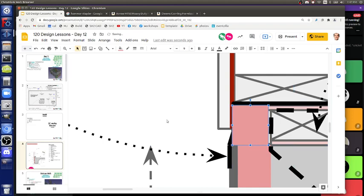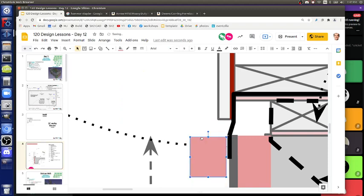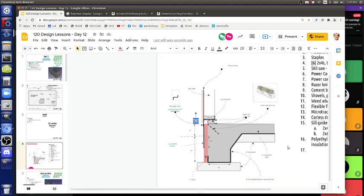So why are we cutting a separate block of insulation and not having a single right sheet? Well, because this is what's already built. What you see here with the gap is already there on the foundation. The foundation is flat, so when we were troweling it, you had to have that. You couldn't have that there because it would get in the way of your corners. So we built it like this, flat. The wooden forms used to be there, so you didn't have anything on edge to block your smoothing operation. So that's what we built.